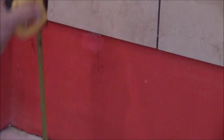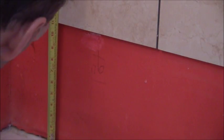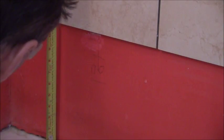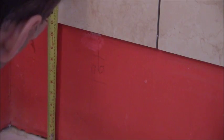All right. So then, measuring down here to right there, it is 11 1/8. So that would be 11 inches, because I'm going to subtract 1/8 of an inch. So that's 11 inches there. So that's actually a lot more than an eighth difference there, isn't it? Measure twice, cut once, measure one more time. Yeah, well, it's 11 1/16. All right, so 11 1/16 would be 10 15/16. So that's how I'll do that one, 10 15/16.